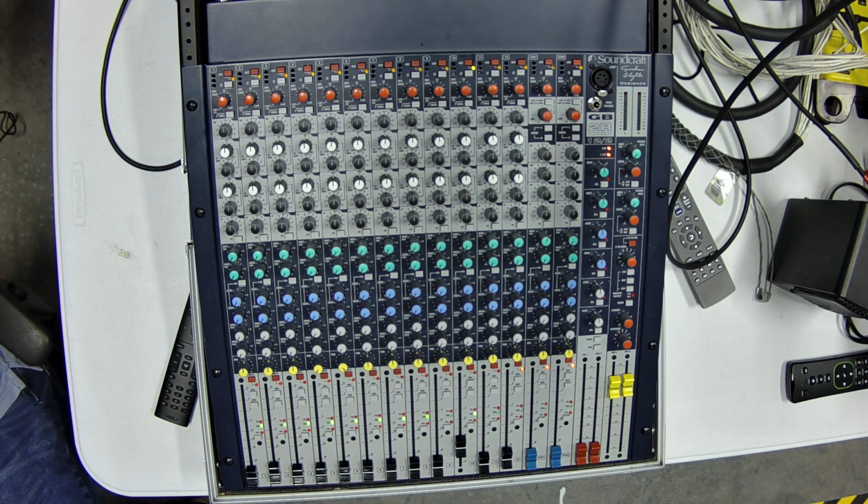Because remember, the low frequency energy goes everywhere anyway. So that's probably getting to their ears naturally pretty easily, so you don't need to focus on amplifying it as much. You can get away with turning up that high-pass filter much higher usually than you think you can, especially for a voice. If you ever looked at any of my consoles on the shows that I'm doing, most people are shocked when they see how high I've dialed up those high-pass filters. I've swept them real high for that reason.